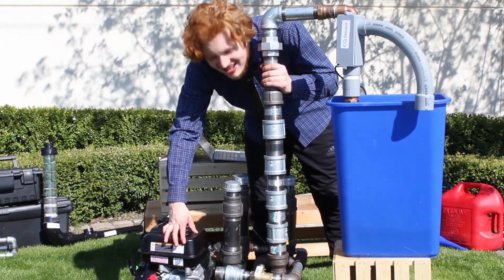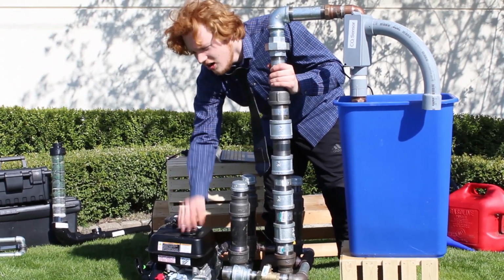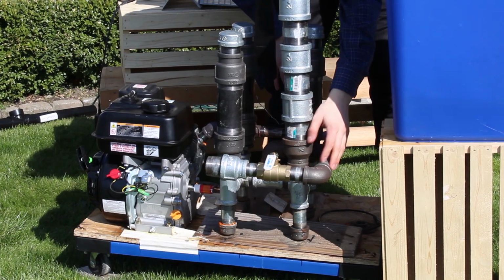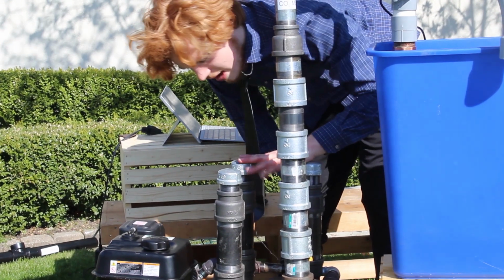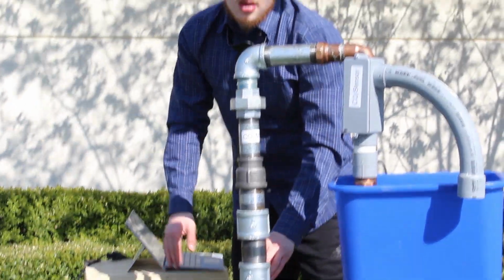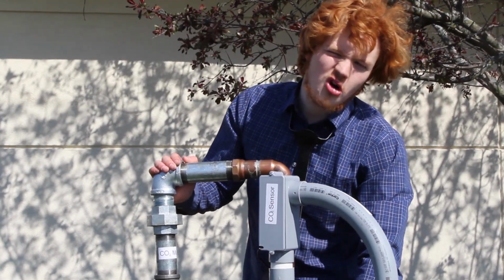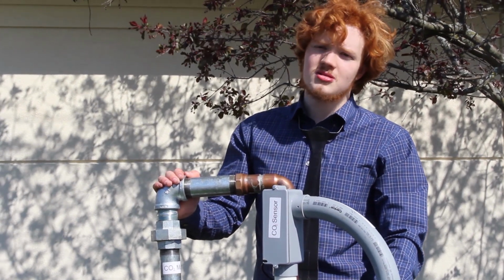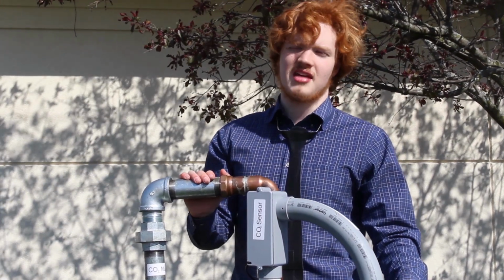Because the engine is very loud, I'm going to explain what you will notice beforehand. When I turn on the engine, the exhaust will flow through this pipe. Because this valve is shut, the exhaust will flow through the CO2 muffler because all 3 prototype portals are blocked. The exhaust will then travel up and into the heat exchanger, where it will be cooled and then dried. Then finally, the exhaust will travel through my CO2 sensor and eventually exit the system. My laptop will be recording the data.